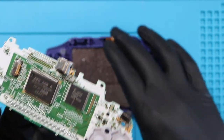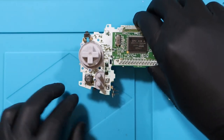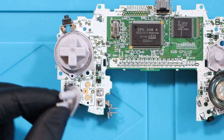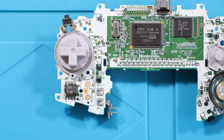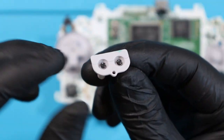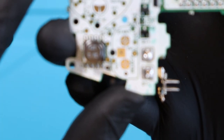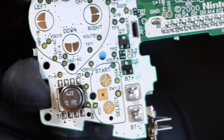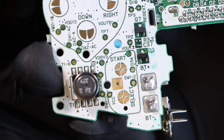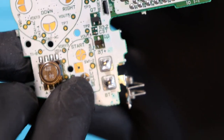How is this side of the board? Should we have a look at that button contact first and just see if that is a case of replace? So this is the contact — is it split? No, it's not. Hold on a minute. So this isn't split, it actually looks pretty healthy. Maybe it just needs a good clean but it doesn't look damaged. The start button looks fine, other side looks fine. I can't see a reason as to why the start button wouldn't work. And that worries me a little bit.